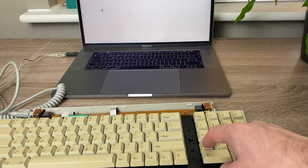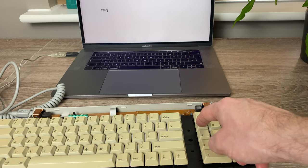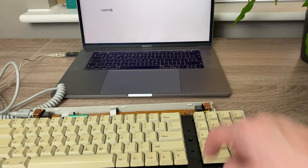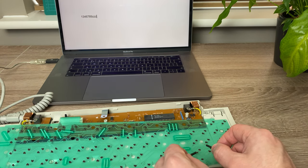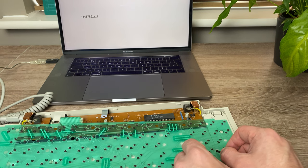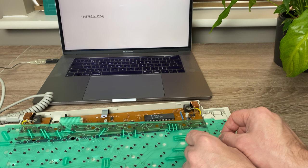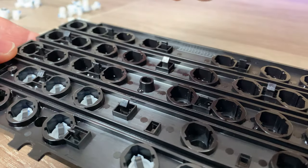With it all cleaned up, it's time to test. And it's still not working — and to be honest, I'm not that surprised. Now doing what I should have done in the first place, I'm going to test all the connections by shorting it out with a piece of wire. And that works, so there must be a connection there, meaning there's no clear break. So my guess is there's too high a resistance when using the key plunger to register the press. And as I swapped all the plungers around during cleaning, I don't think they're the issue.